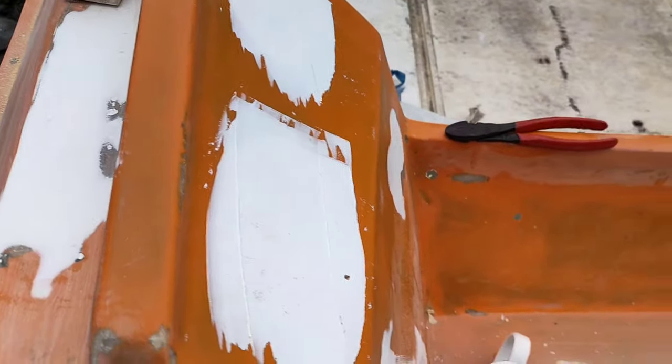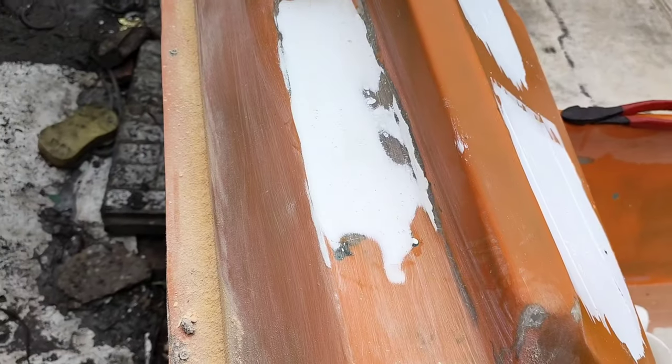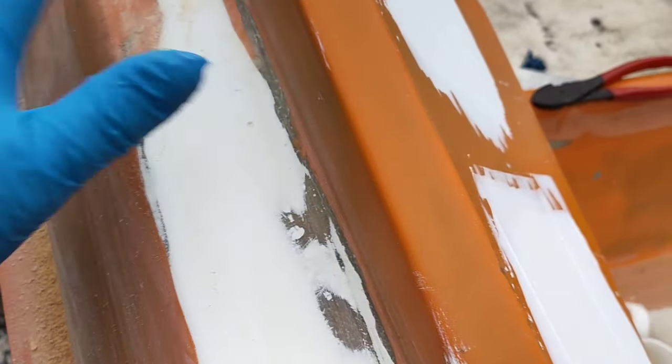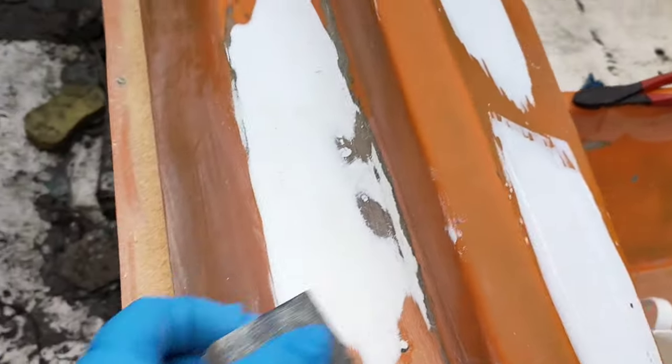We are out here today. I'm going to start sanding down these repairs and get her ready for... Let me show you. So obviously we've got repairs everywhere on this boat now. I need to sand down. Started this one, most of it being done by hand with a block of wood. But you're still getting, even just trying to go flat, it's difficult. The boat's so wavy, it's difficult to get it right. But you're just going to have to keep going.